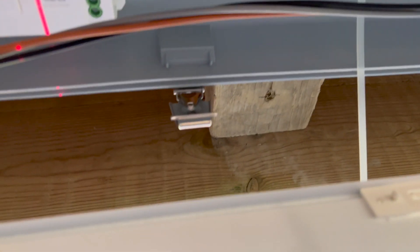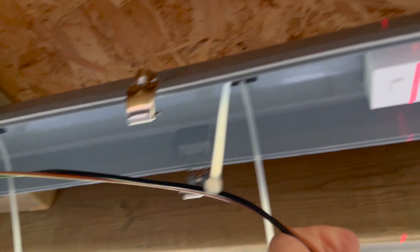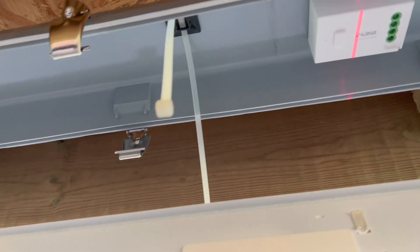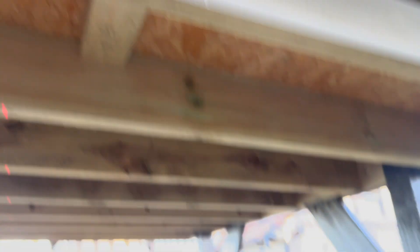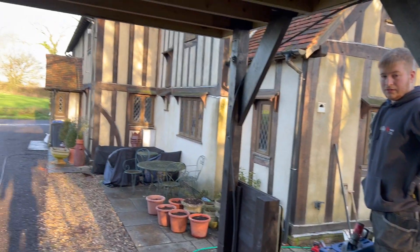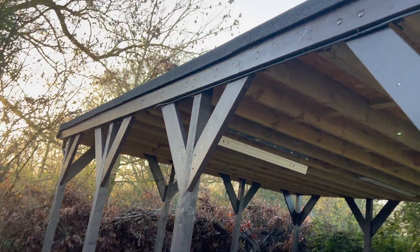The earth's going to go to the end, and then that one's going to go in with that light, then we're going to run a switch line and neutral to that one. This one will go into there, that one will go into that — we've got double connections in the light. Then we run a switch line and neutral, leave it hanging until we power it up and then compress it. Then we've got the folds that Ollie's just clipping along there and down.